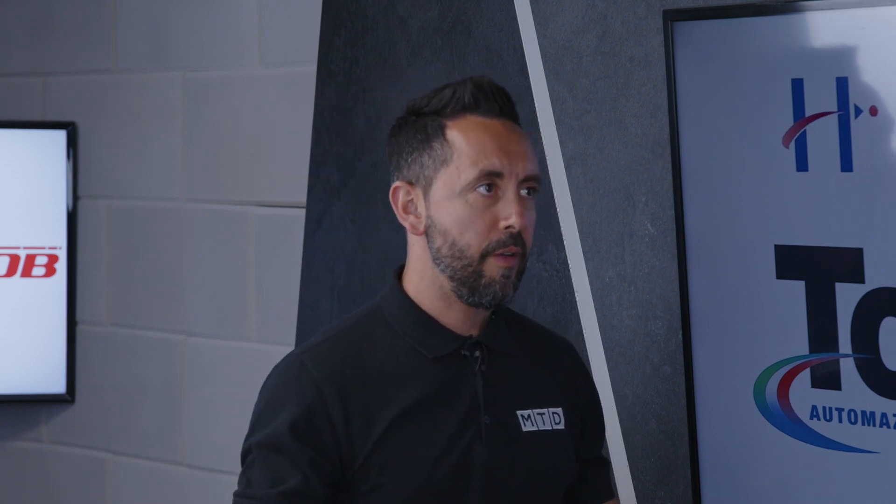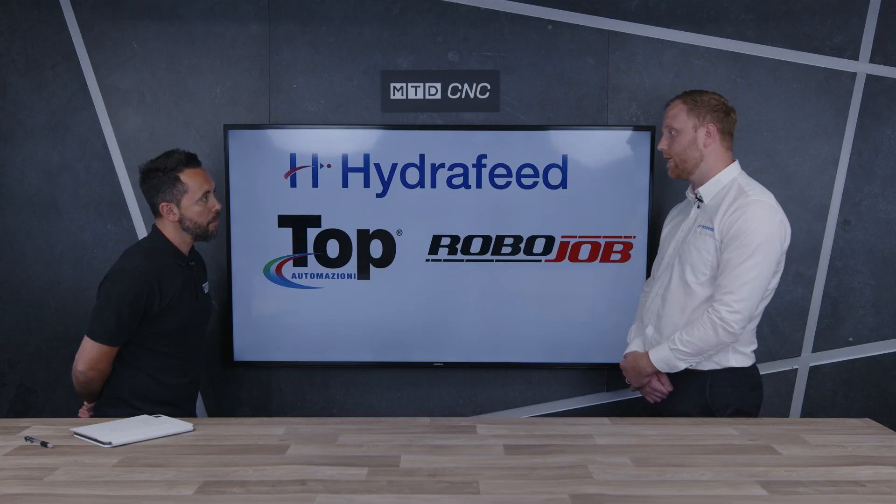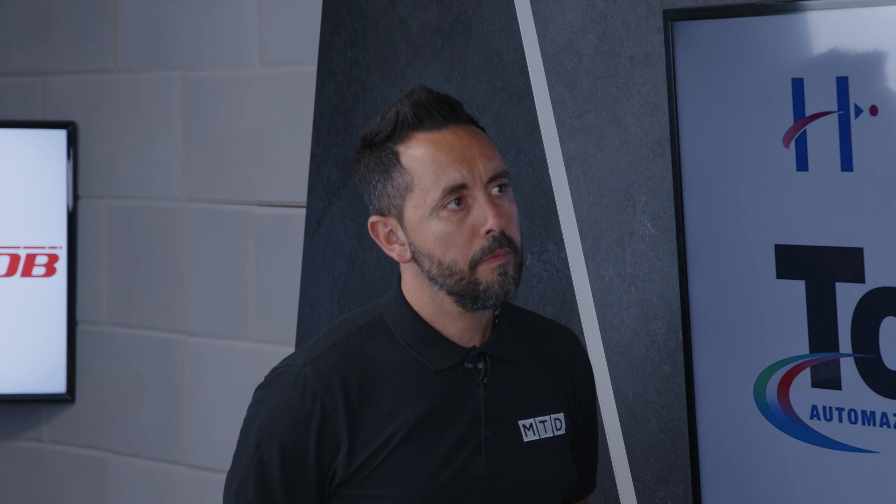Hydrofeed have sold thousands of bar feeders over the years — the short bar feeders, which you actually manufacture in Milton Keynes. We do short magazine bar feeders starting at one metre length, best suited to one metre length material, but they can also have a bar support unit added, giving you the capability of loading a 1.5 metre length of material, depending on the length of the headstock of the machine. We do a pneumatic bar feeder up to 65 millimetres in diameter, and we also do an 80 millimetre diameter bar feeder. We also do electronic MSV bar feeders, which are self-adjusting and servo driven. So a large range of bar feeders for certain applications.